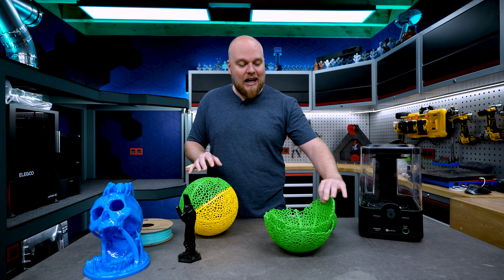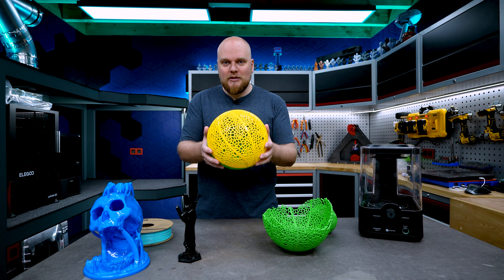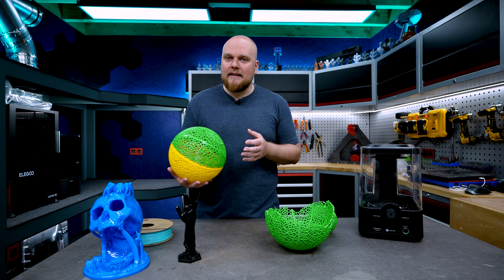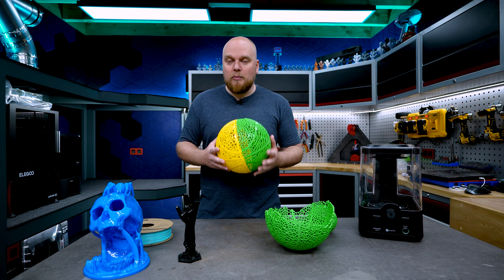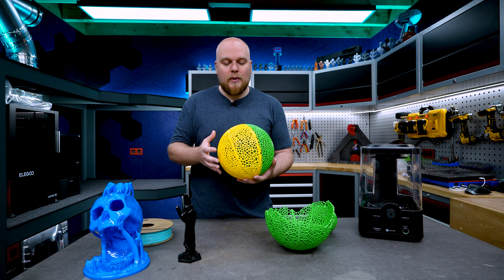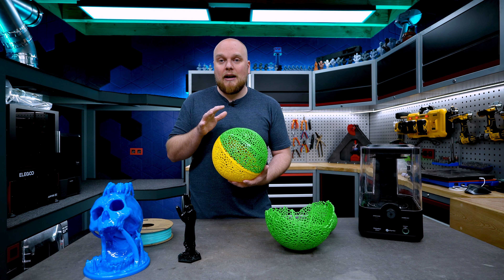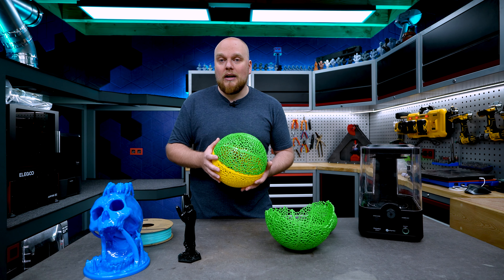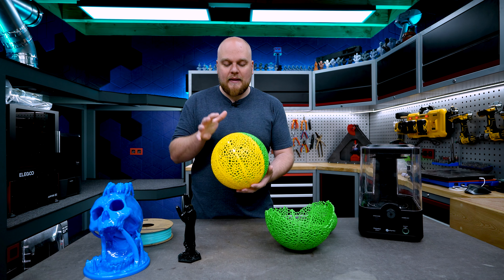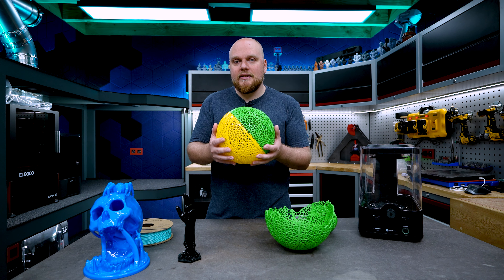So we have done all the testing and we can see that the regular PVB ball is actually pretty easy to break when you drop it. But the smoothed balls actually performed not that bad — it did break from four meters. I don't think the original airless ball would break from four meters. But it was really interesting to see that smoothing the PVB gives you some extra very nice properties: superb layer adhesion and breaks that are not linked to layer lines. This is probably the same if you do ABS smoothing — this is just a very non-toxic way of doing it.